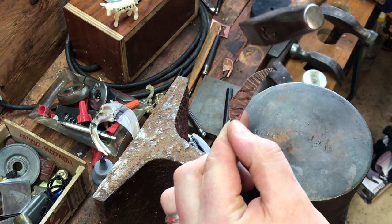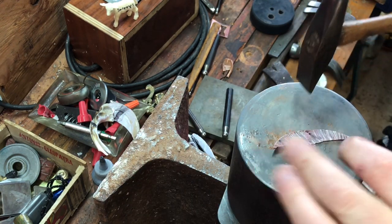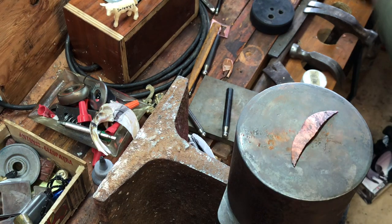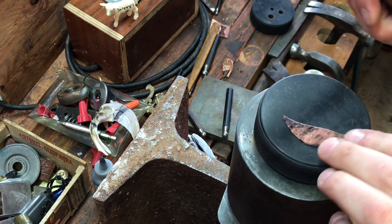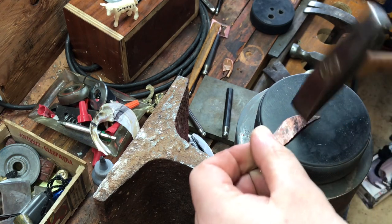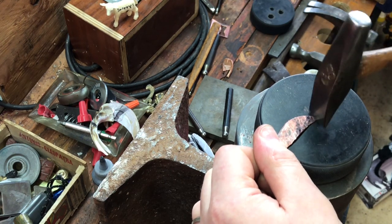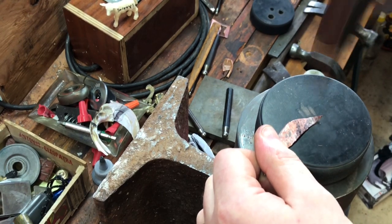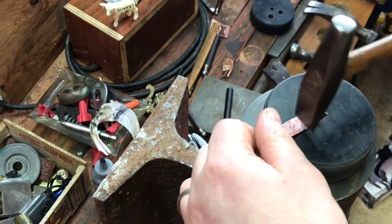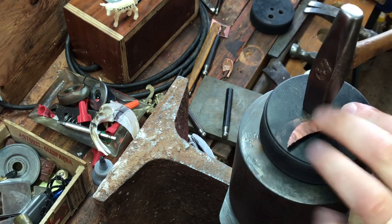So now you have this. It started to curve one way but I was able to curve it back — and this is the closed side, so I was still hammering on that open side. Now that we've done one side of texture, the other side has kind of a show-through. What I'm gonna do is grab one of my hockey pucks, put that down, and make sure my lines are the same. Line it up and then do the same thing, focusing more on the open end than on the spine and the folded-in edge, and just add texture. It will start to curl up, come back down, and then I'll hold it with my fingers if I need to.